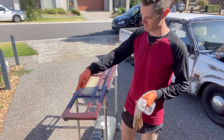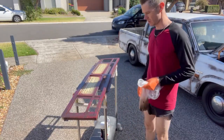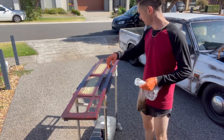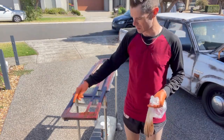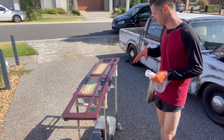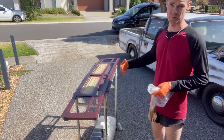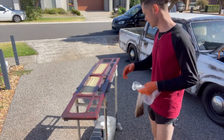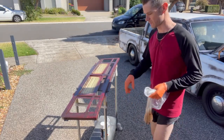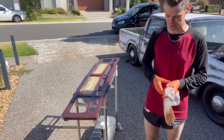Anyway, today we are at this point. I've welded on the other side, the other bezel, welded in the grill, and welded on the mounts to the truck. So I have fitted it up to the truck. It does hold itself up, and I've laid down the first few coats of paint. First coat was primer, second coat was a red, then I've splashed brown all over it because this is going to be patinaed at the front to hide all the imperfections.